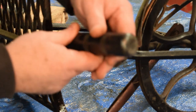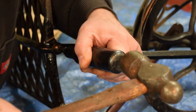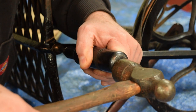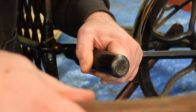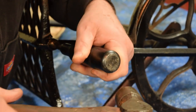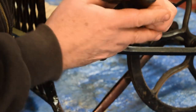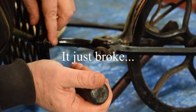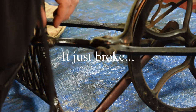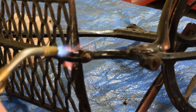This is an impact driver. What it does is it turns as you hit it. Sometimes this will break them loose. If not, we're going to go to some heat. And that just broke.